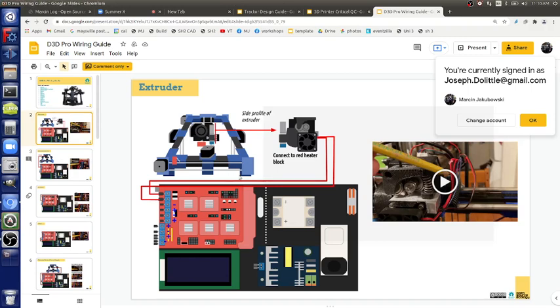Extruder. What's on extruder? Got the lower heater block. Yeah, a few elements. So let's go through each slide so that you can just follow this exactly, and you can say I got stuck on step on page 2. So this is page 2. Can you do the extruder heater? Does that make sense? So that's the top pin of that block of those blue pins. It's labeled D10 on a RAMPS board. So here, this is pictorial. It's not even doing any labeling.